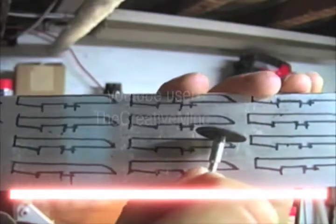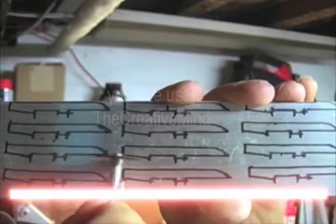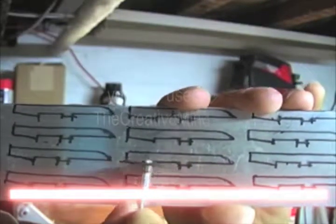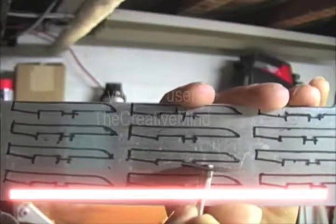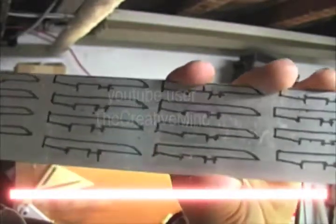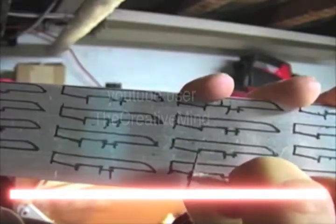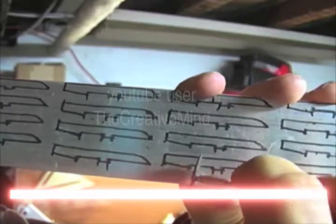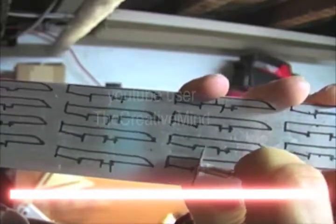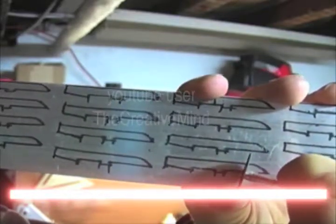You're going to trim and form this rounded edge over here. We're going to cut down in front of the fin. You're going to cut across right underneath the dimple here as well. Now, to actually get underneath your emitter fin, take your cutoff wheel and make a bunch of upward cuts right up to the black marker. Then take the wheel and form it out just like this. Do the same for the other side too.